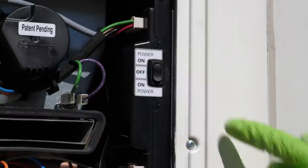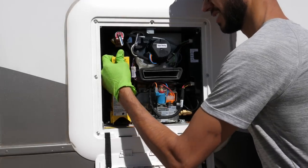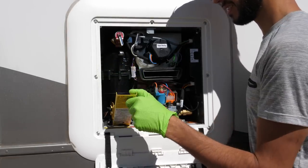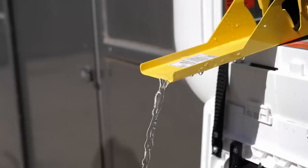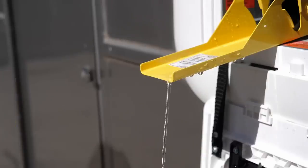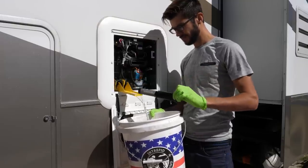On the power switch for the appliance, switch it to the off position. Locate the yellow easy drain lever and lift the latch with your thumb while pulling the drain lever down as far as it will go. Water will begin to drain from the water heater down the chute. While only about a gallon of water will come out, I like to catch the water in a bucket.